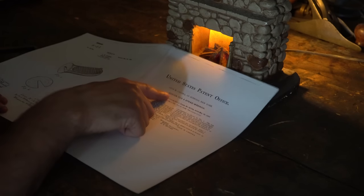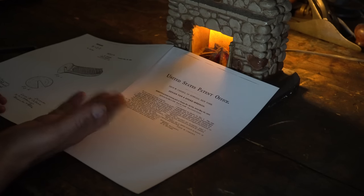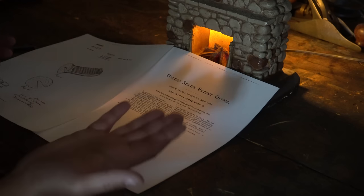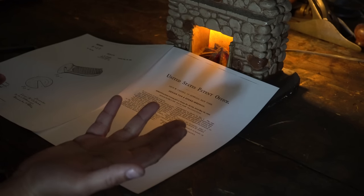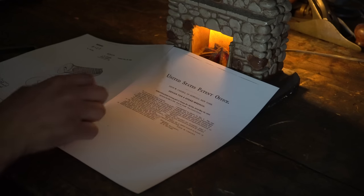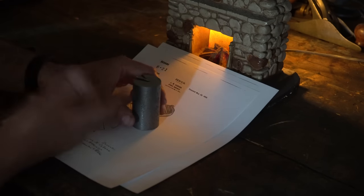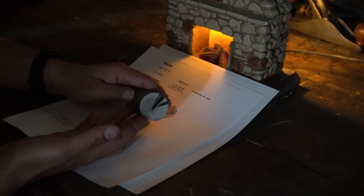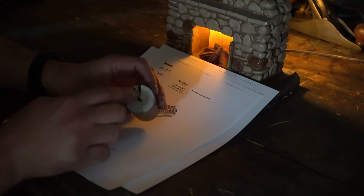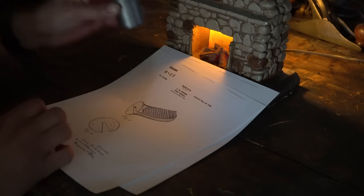This is a design patent, so there are few details. It's more just an idea and less actually how you produce it, so I will be dealing with that. We have a little bit of steel here, and I have other pieces of steel, and I've already tried to mill a kind of V into it, but the angle doesn't really work, and I broke the bit, so it's going to be a little bit difficult.